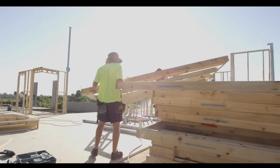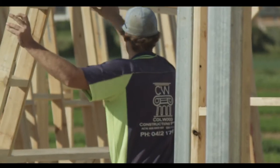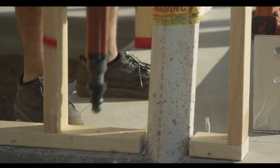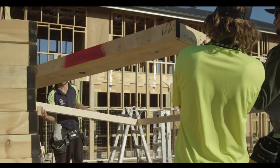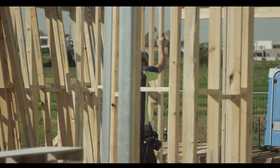Most of our timber frames are put together off-site and are delivered to the job in large packs. They are then put together by our frame carpenters in accordance with the design layout. This type of installation practice is called pre-nailed framing. Depending on the complexity of the build, we may also opt to build the frames ourselves on-site, which is commonly known as stick framing. This process does take more time to complete, so the use of pre-nailed frames is a far more time-effective way to construct.